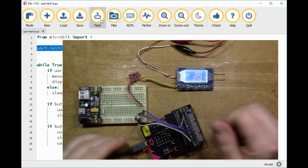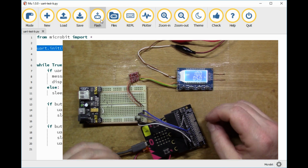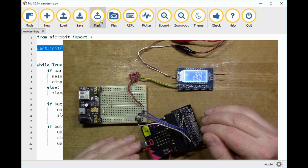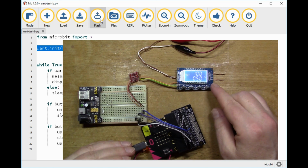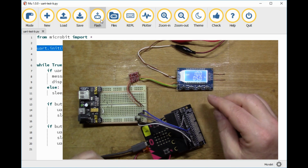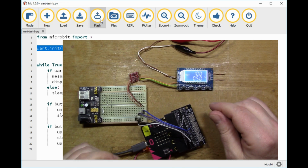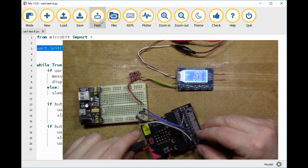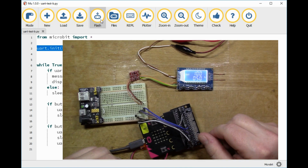So that's really nice. I'm not sure what I'm going to use that for, but obviously you can build some kind of signal generator that's controlled by a program. So for example, you could send various frequencies out. You could even play a song with it, although I'm not sure how good that would sound. But yeah, with this quite neat little level shifter, we're able to connect a variety of 3-volt systems into 5-volt systems and have them all working nicely together.